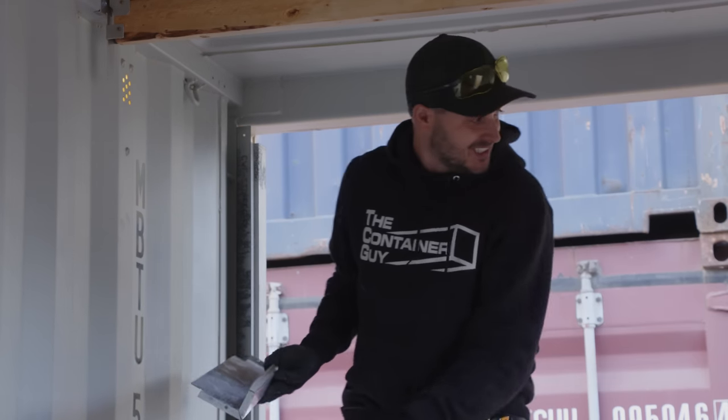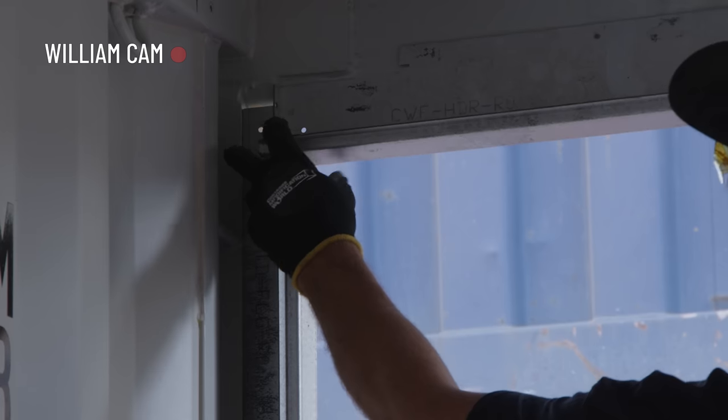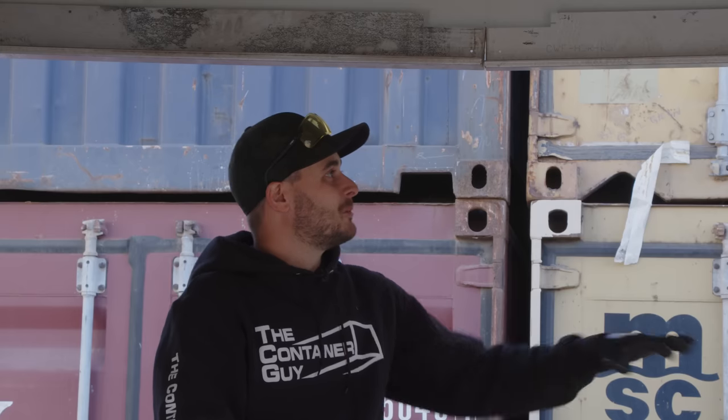Grab a marker, eyeball it — cut it straight. Good thing somebody cut it straight. One thing we do notice is when we install the door flashing kits, every container seems to be within a millimeter of each other — they're all ordering rubber door seals to fit the doors and they all have to be perfect. But when we get to the doorway for the wall flashing kit, we do find variances in every container, even from the same manufacturer. So you have to be more of a fitter. There's always going to be one or two little problems — rogue welds, something in your way — that you'll have to solve, but it will go in if you use your head, and it will make your container modification much cleaner.